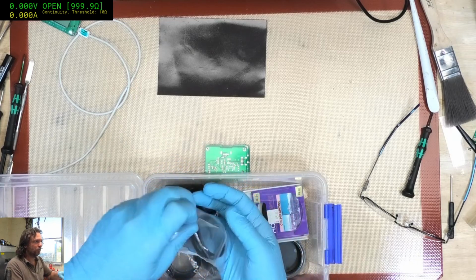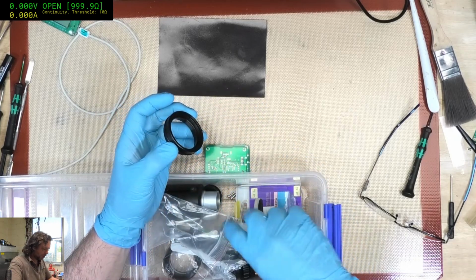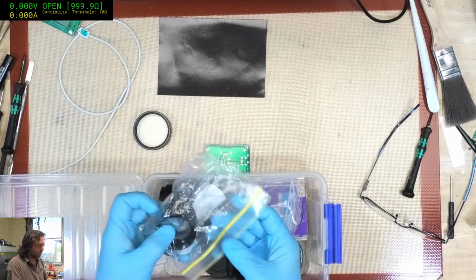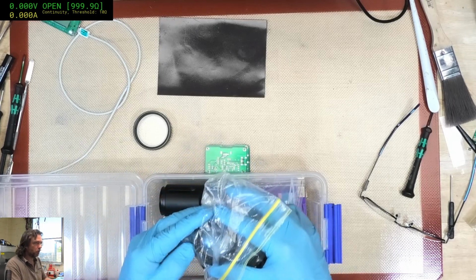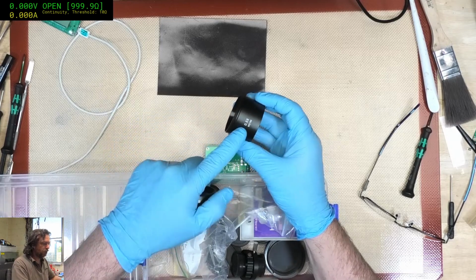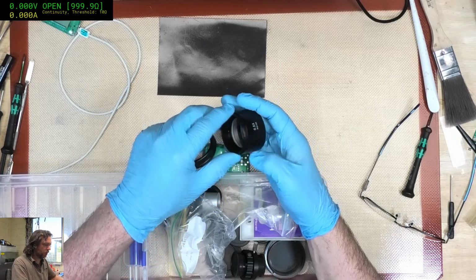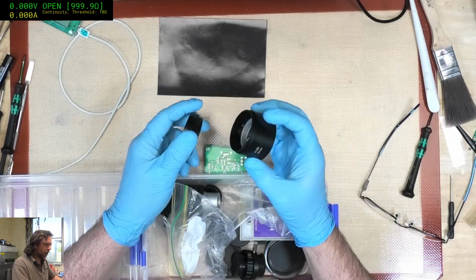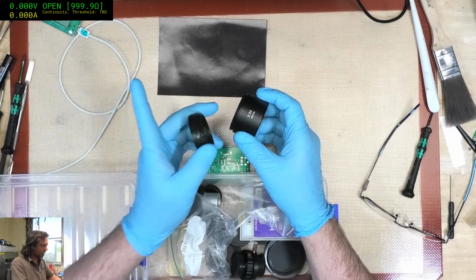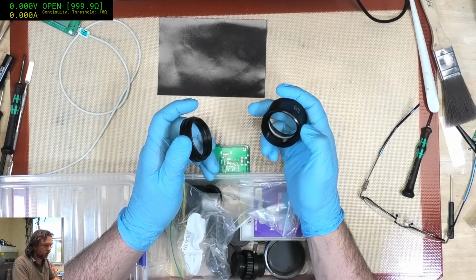Oh, on the iPhone. Oh, right. Okay. But yeah, this here, instead of a Barlow, I know we've diverted, Jim, from what you're saying. So these are all just the random bits and pieces of crap that didn't work out when I was trying to work out what microscope setup I had. So this here is a 0.5 Barlow, which was all that we really had access to initially when everyone started jumping on to repairing things. And I was never happy with the 0.5. I bought it just to see what it was like, but the 0.7 is the one that I was looking for. I was actually after a 0.65, but 0.7 they came out with, so I was like, okay, I'm happy with that.